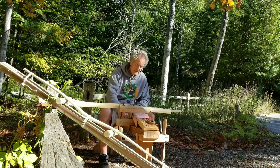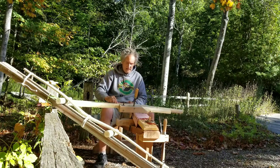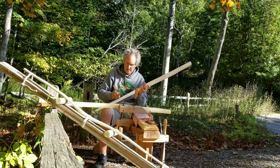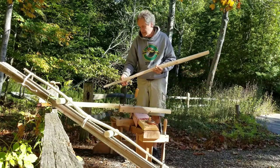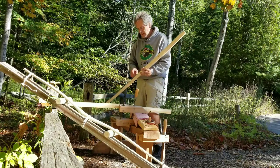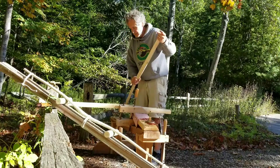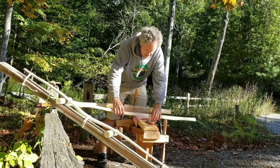The third thing is marking the sides. Either just cut some things out of cardstock, mark them along the sides so you can work down, or else use something like this to mark the sides and work down to them. And if you do that evenly, the face is the same width from length to length on this limb as it is here. You have an equal amount of thinness taper here as you do here. You are going to have a floor tillered bow. So it's the old game, work smarter, not harder.